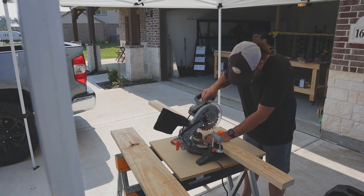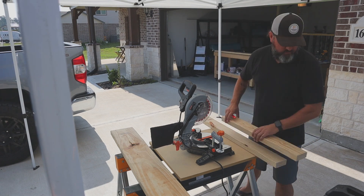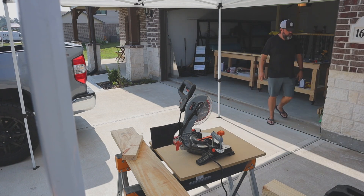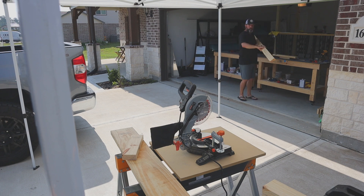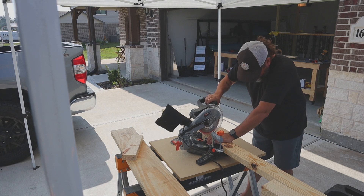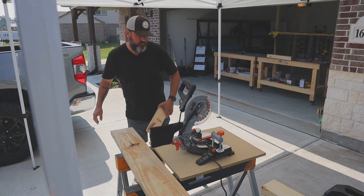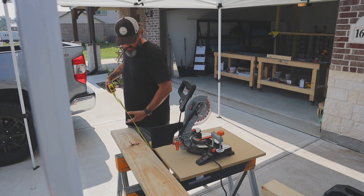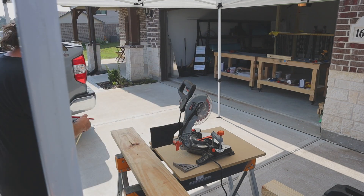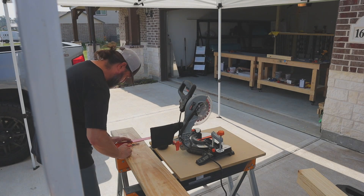Pretty simple stuff, but the woodwork is actually pretty satisfying because it's very forgiving — when you're doing stuff like this it's fairly rough, not super precise. What I did was measure the distance from the floor to the rear spar where it's supported by the posts, either at the inboard or outboard end. Then I cut a half inch less than that so I have room to work some shims in there to get the fit exact.